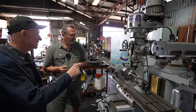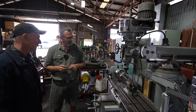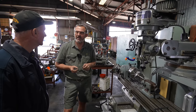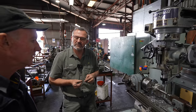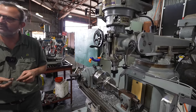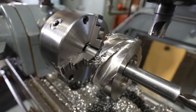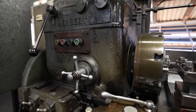So that becomes an impeller. We have a diffuser in front of it, and we divert the water so it hits at 90 degrees to the blades. We rob drive off there and put a hydraulic motor on the back of it to make our irrigators drag along, pull themselves along, with hydraulic power, grabbing the energy from the water flow. That's just another little thing that they do here. All sorts of goodies to play with.